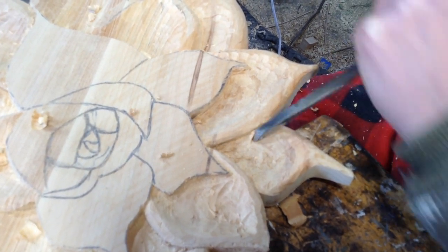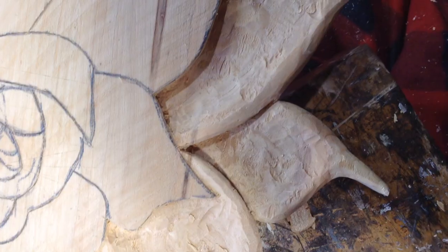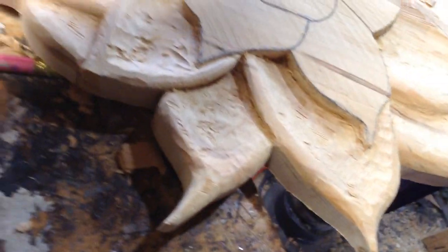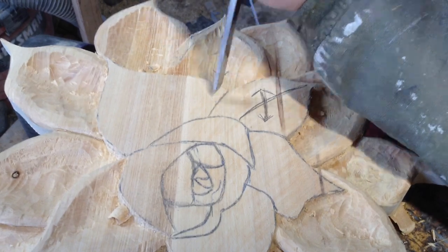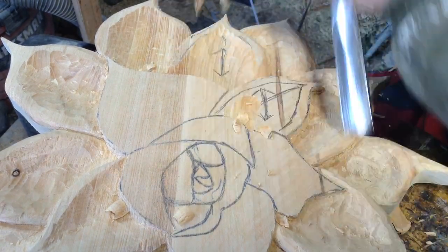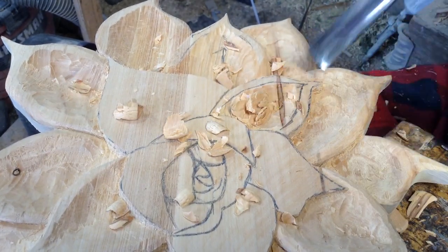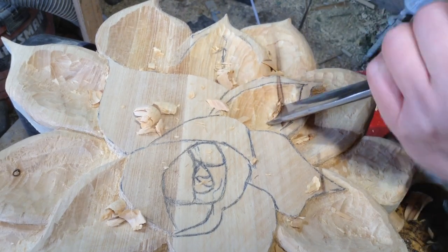On those edges I cut about a quarter inch down — I'm going to cut that in half to about an eighth inch. With a skew chisel I'm just going through and making an undercut under those leaves. You can see it just goes in at an angle creating those shadows. At this point this is all very rough — I'm not cleaning any of this up, just creating those initial cuts. I usually don't draw the grain lines on here, but I'm going to so it's easier to tell what's going on. I reinforce that stop cut, and I angle into the grain on both sides to avoid chip-out, roughly cutting short of that outer edge of the leaf, and keep going until I get about a quarter inch down on all of these leaves.